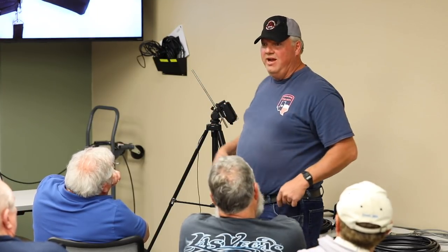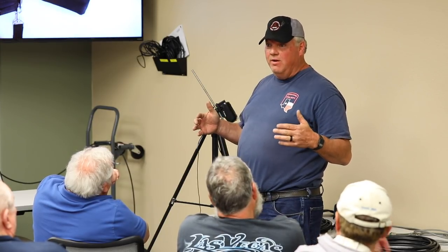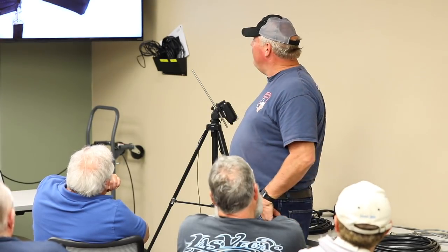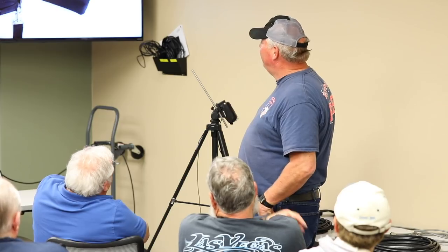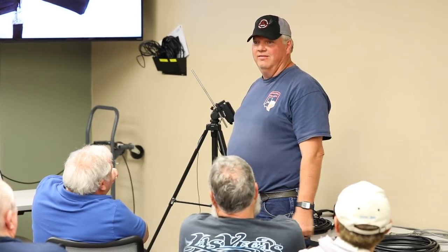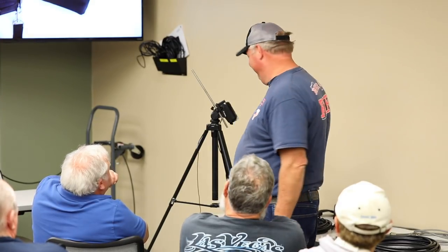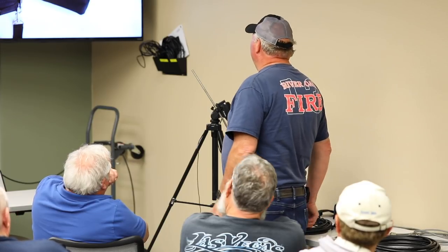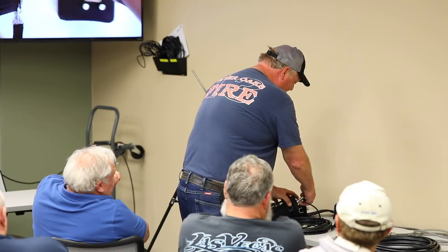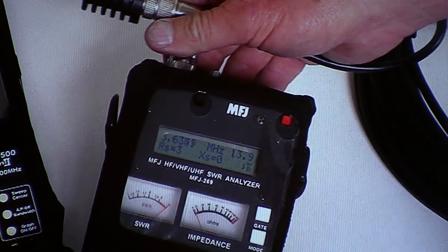The reason it's 3 ohms, and we'll talk about this later, is that this is a half wavelength piece, so a quarter wavelength stub now looks like a short at that frequency. So we've got a quarter wavelength piece for 80 meters, so it looks like a short, and it's not going to work well. We don't have a piece of coax that's quite right for 40 meters. But what if we went to 20 meters? Let's try 20.